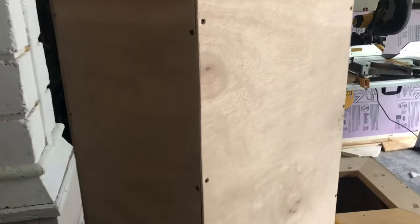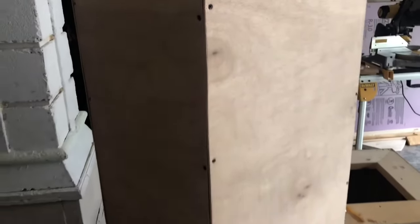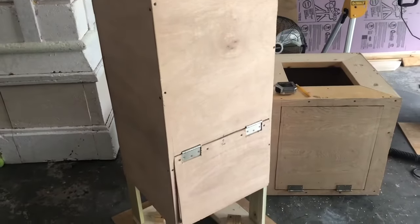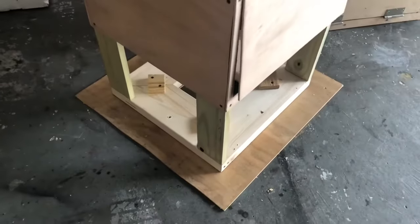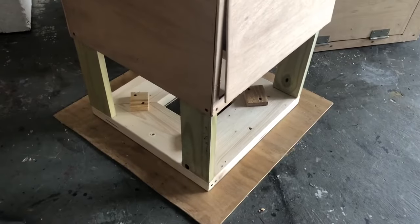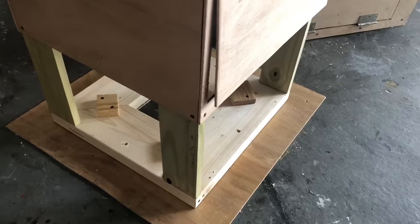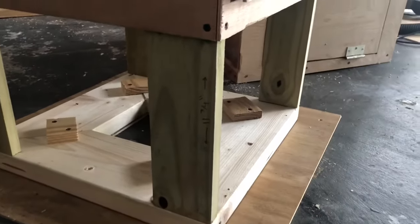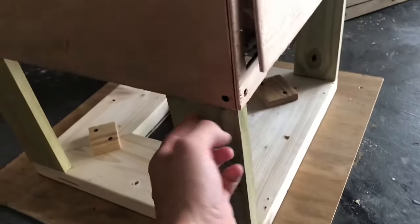Next I skinned this portion of the column with quarter-inch plywood, making sure to have each corner overlap so that it creates a nice 90-degree angle. In order to get the most out of the four by eight sheets of plywood, I had to make these sections four feet tall, which leaves a gap at the bottom. But the foam will eventually cover it up — and the good thing about the foam is that it acts as an amplifier, so if you wanted to put speakers down there, you'd still be able to hear it through the column. This section is 11 and 3/4 inches from the bottom of the column up to the plywood.